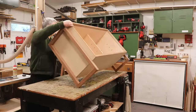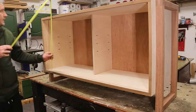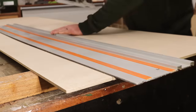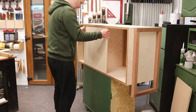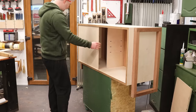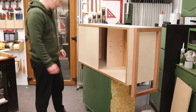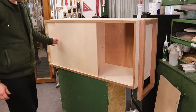After a few hours I can remove the clamps and lift the cabinet up and measure up for the doors, which I cut with a track saw. The trick here is to creep up on the size so that they can be lifted up into the deeper groove on the top panel and then dropped into the grooves at the bottom. I expected to have to remove a millimetre or two of material to get these to fit but I somehow managed to get it right on the first attempt. Each door was cut about 25mm wider than the openings so that they overlap in the centre and you don't see any gaps when the doors are closed.